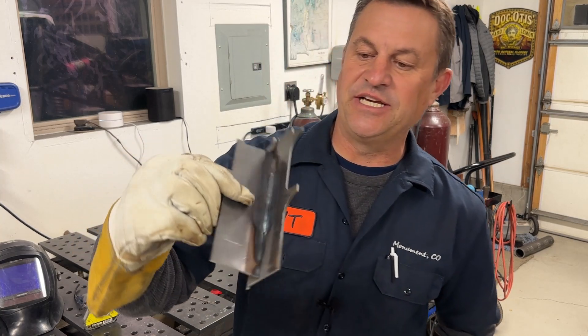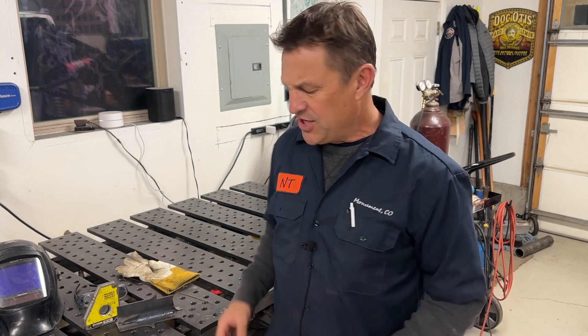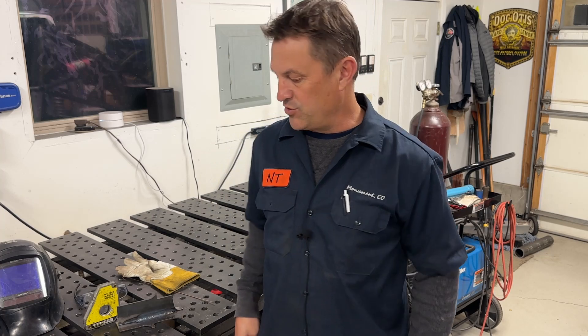I do love the results from TIG welding. That was a pretty good weld — not a perfect stack of dimes since I was talking while welding, but it will hold. I put welds like that on our race trucks and I've never had a TIG weld fail. With MIG welding you can never really tell if the fusion is happening, but with TIG welding there's no doubt. I talked about a lot of tools today — links are in the description below. I've also referenced several videos I've made — those links are in the description too. Hope you learned something, and if you're a professional with a better technique, I'm all ears. Thanks for watching — please subscribe and leave a like. See you next week!